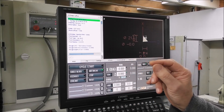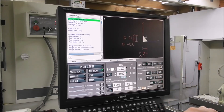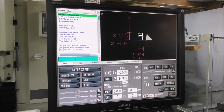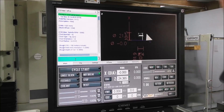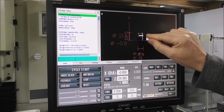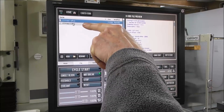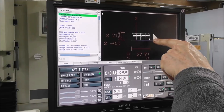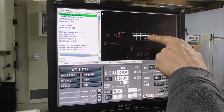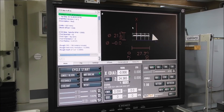I know that's pretty clunky and there's probably a far more elegant way of doing it, but from a simplistic engineer's point of view I can visualize that it's going to work, and it's safer. So we've got the four different sets of work offsets — G54, G55, G56, and G57 — entered within the software. The code 'NUT 1 off' shows the position of G54 graphically. If we go to the '4-off' version, you can see the four different positions of the four work offsets, and that looks about right. The machine should now go through the code and machine those four different positions.